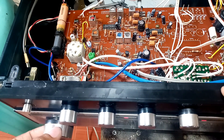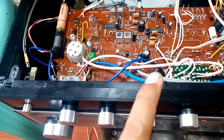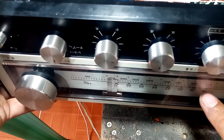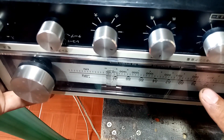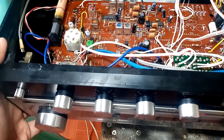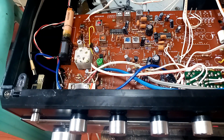I check the FM sound using a familiar station — for me, 89.1. I bring that 89.1 down to the 76 mark on the dial, because the dial starts at 76. But I could not reach 76; my lowest was 78. So I re-channeled from 88 down to 78 — that was my limit, I could not go further.